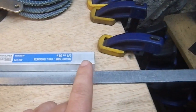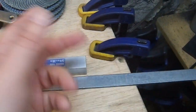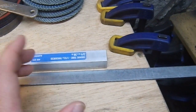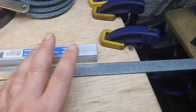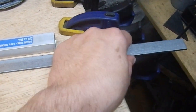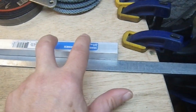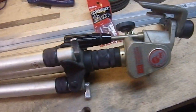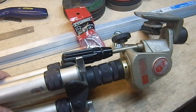On the camera end of the boom, I'm going to use a piece of three-quarter-inch wide steel bar stock. I chose steel over aluminum even though you're mixing metals, because I find more uses for steel. I couldn't find a pre-made bracket with holes in the right place, so I'm making my own. I'll cut a piece, drill two holes to attach it permanently to the boom and a hole at the end for the camera. At the end of the whole process I'll take a picture with my phone, since the camera in question is in my hand right now.